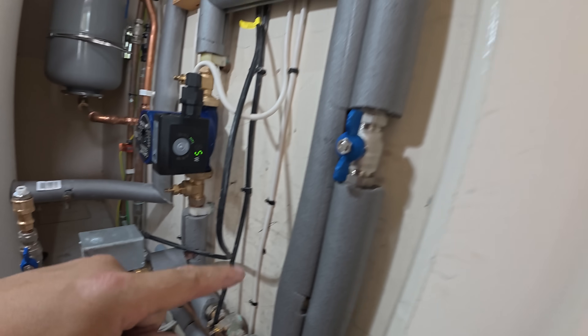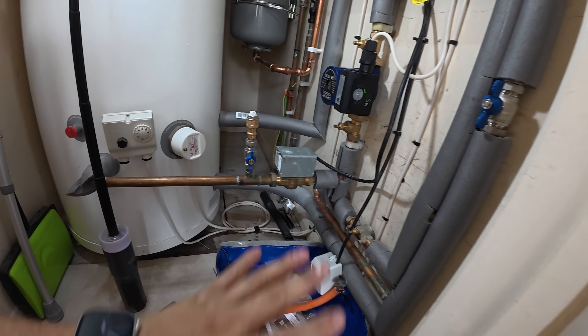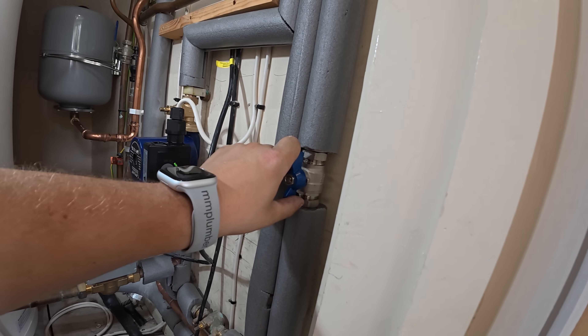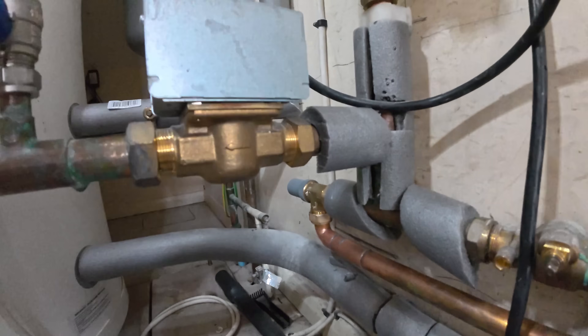So that was it — we just needed a new pump. But obviously to fit that pump we had to do some alterations: make the pipework a little bit longer and cut the return isolation valve in so I've got perfect control now. If I ever want to do any work by the cylinder room I can just shut them off and deal with everything on the heating controls without draining the whole radiator system. The new bypass is tucked in here. If you liked today's plumbing video, please give it a like, drop a comment below, subscribe if you're new, and I'll see you on the next one.